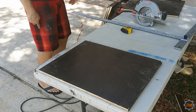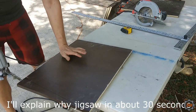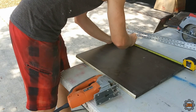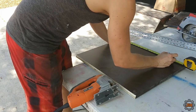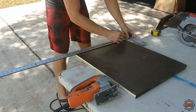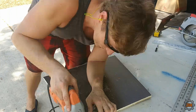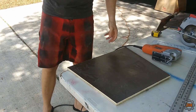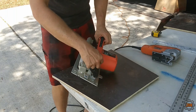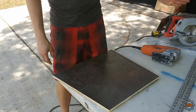I'll still use my jigsaw for this because I still have to make the top, and I want to screw all this together before the top is built, so I'll jigsaw this all out. The other side is gonna be 20 and a half with two and a quarter on one side, and then 20 and a half minus two and a quarter gives 18 and a quarter. It looks pretty straight. You don't have to cut these with a jigsaw — you can use a circular saw — but mine sticks pretty bad right here.